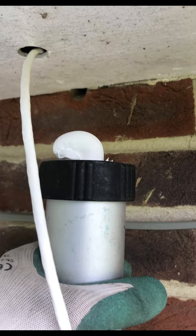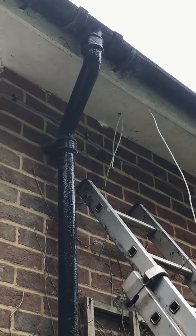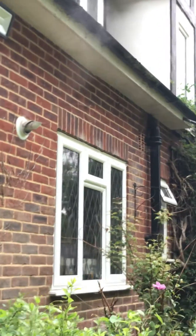But the first thing we've done was got the cable through, and then the next step was to drill at one spot — which we're going to fill in — but that was just to draw the cable through because unfortunately we couldn't drill directly from the garage as there was no access there. After that we've pulled the cable through this hole, as you can see, and that cable is going to be drawn all the way along. You can see what we've done here — we've actually looped the cable, which is where the first camera is going to go, and then this cable is going to be tacked all the way along.